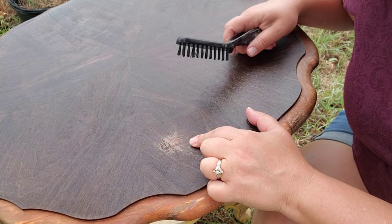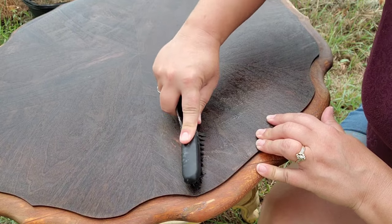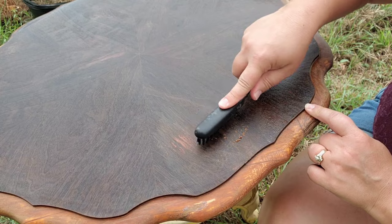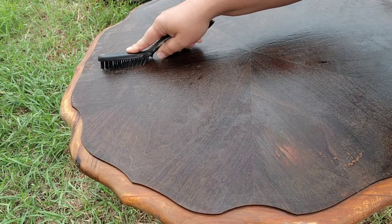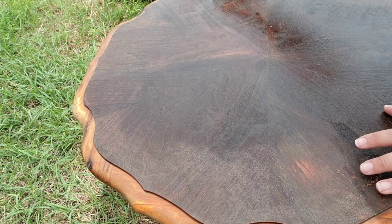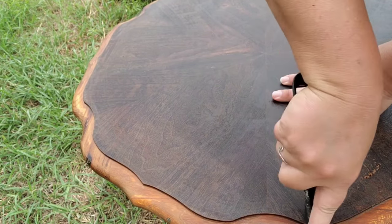This is an area of finish that did not come off in my initial scrubbing. I got it wet and I can actually feel the varnish still on it. But because it's still fresh, if I just apply a little bit more pressure, it actually is coming off. So if you pay attention and do more scrubbing, this might actually finish up with the second coat. I've got some sections all around the table like this, so I'm just giving it some more pressure in the direction of the wood grain. When you do that, it'll start turning brown — so the finish is still coming off.